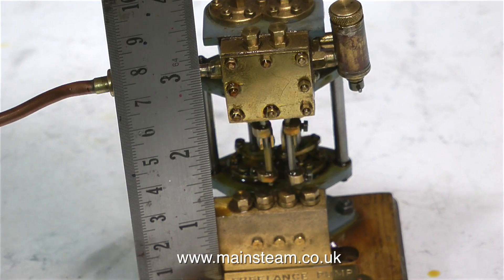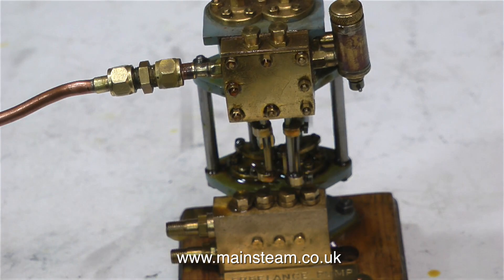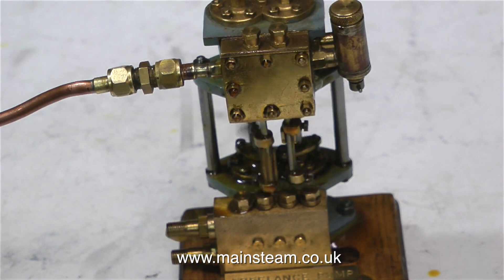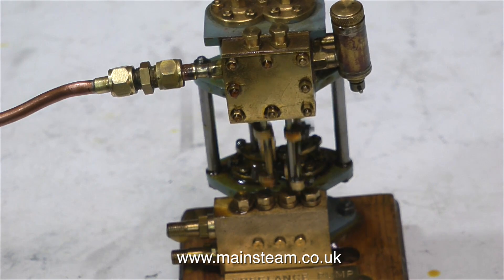I thought I would take this opportunity to have a good look at this small pump. I know there are one or two leaks around the steam chest cover, but that's not a problem. The main problem is it's quite tight, but really that's because it needs running in — it's never been really run much. Currently I'm giving this a run. I oiled it thoroughly in every area, including the water chest, because the water pistons are lubricated by the water going through the pump. As there isn't any water going through the pump, I was a bit concerned that they would wear out, so I put some oil in there.